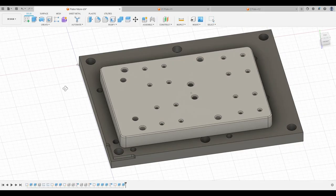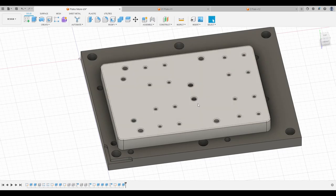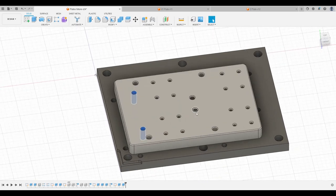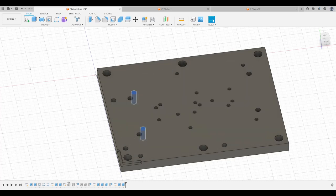So this is basically what gets done on this part. And this establishes these 6mm dowel pin holes, which I'll use to hold and locate the part for op one. I'll call it op one, since I'm only facing and making locating features. I'm calling that op zero, and that gets done down here in the corner as is indicated here.